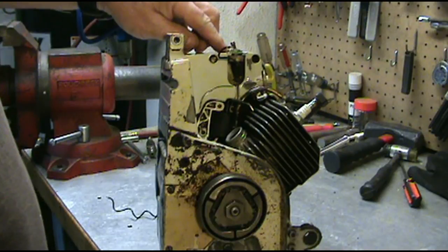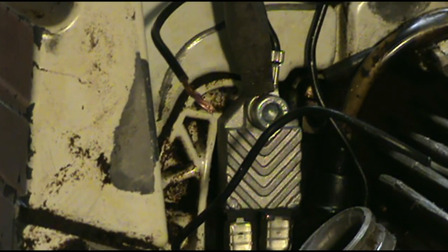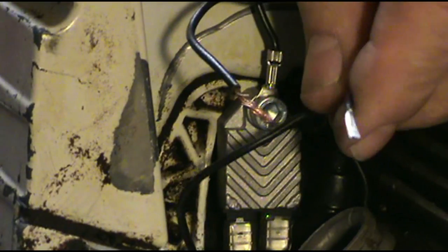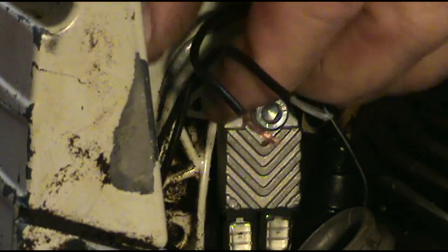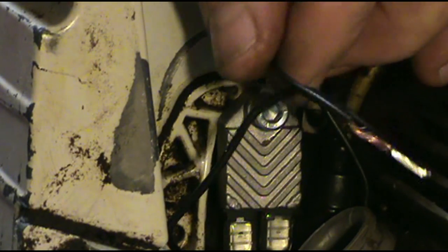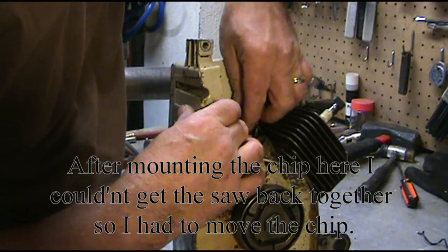What I have done is I had to go find my own screw to put in here — the screw that came with the kit was garbage, won't fit in here. This is a six millimeter. So I got it tightened down, I shortened this wire here. Now I'm going to put all three wires together and put the wire nut on.